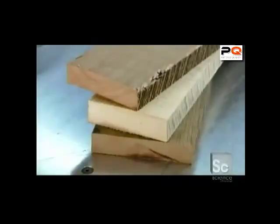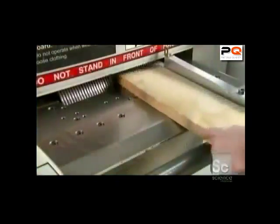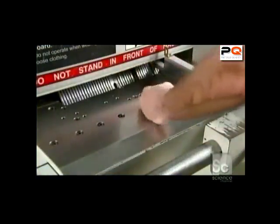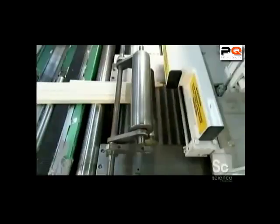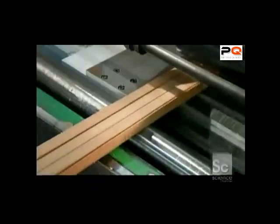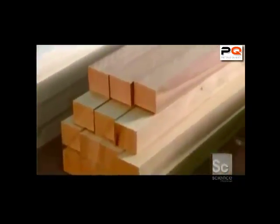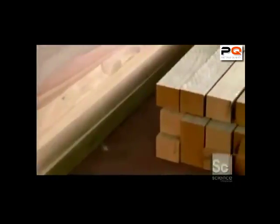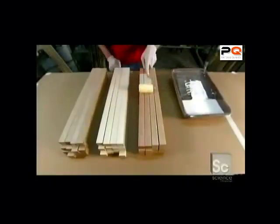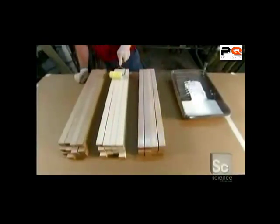Modern paddles are often made from a blend of hard and soft woods for a product that's strong yet lightweight. First, wooden boards are fed into a multi-bladed ripsaw that slices them into uniform strips. Each strip has a flat, smooth joint on the side. Glue is rolled onto those flat joints, and then the strips are pressed together. These glued sections will be used to make paddle blades.